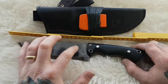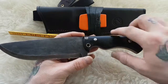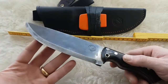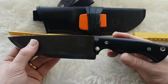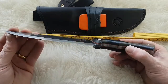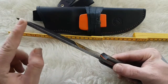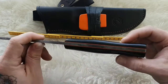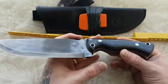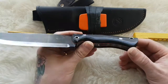It is a 6-inch blade, which is most of our preferred cutting type blades. It's a 4 3/4 inch handle, which gives you nearly a foot of O1 goodness. It is O1 tool steel and it's treated at 58 HRC is the hardness, and for reasons I'll get into in a minute. It is a 5mm full tanged 90-degree spined woods knife, French trade style, for reasons I have mentioned in other videos, but I'll get into here.